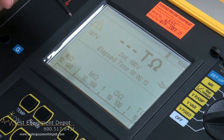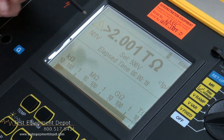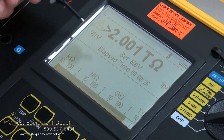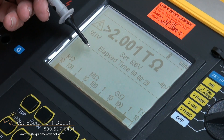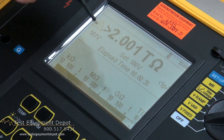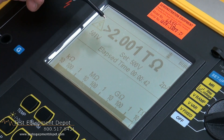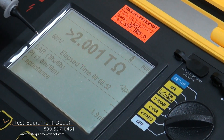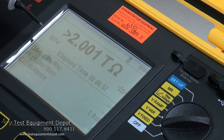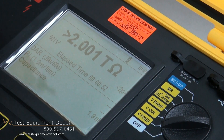Here is a display of the test in real time. It shows us the voltage, the given resistance of our test specimen, and we get a bar graph or gas-gauge display as well. Elapsed time into our test — so if we are doing a time test, this will tell us how far we are along into the test, and we will hear a beeping function indicating the storage rate we are recording at. Lastly, we see the display that comes up after the test is complete: it shows us the test result, the elapsed time of the test, and the automatic calculation of the dielectric absorption, polarization index, and capacitance.